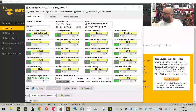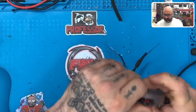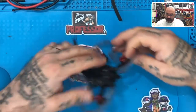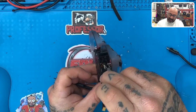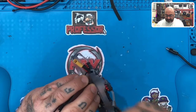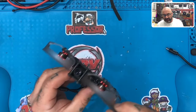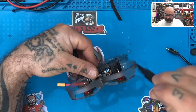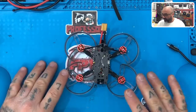We need to get our drone ready to plug into power, but your VTX is going to get hot, so we need to do something about it. Go ahead and disconnect your USB — pull it gently. This plug right here is your VTX plug; it's got all your power wires. We want to disconnect it — I'll use some tweezers to get in there and disconnect it. I don't want to take the top off because it's a pain, but you can if needed. I've now disconnected the plug so my VTX doesn't power up and overheat.